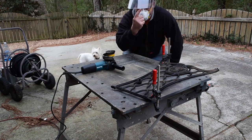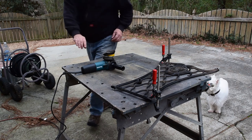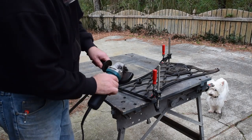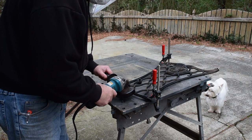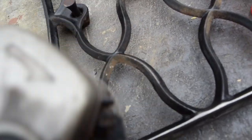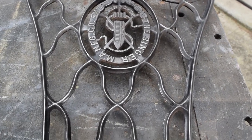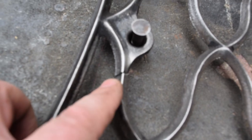Okay, ready to go. Dust mask, face shield. Unless you want to lose your sight, I wouldn't leave this behind. And here's what it looks like after we've got all the paint, most of the rust ground off of it. We've also got a crack in the cast iron right here that we're going to have to take care of as well.